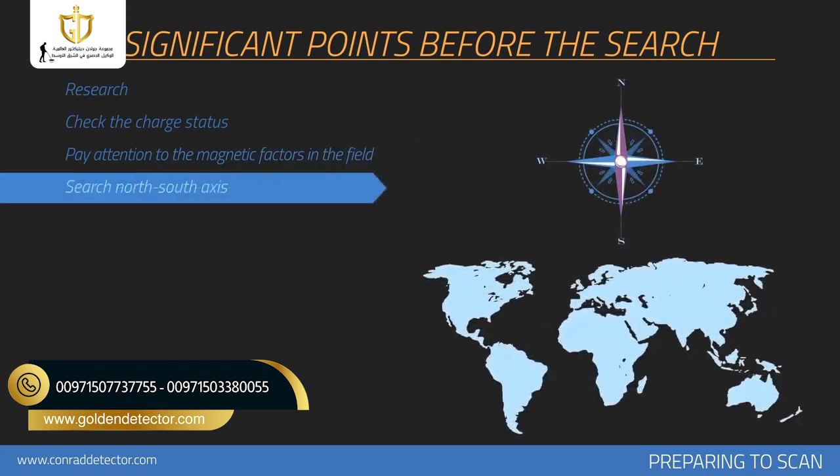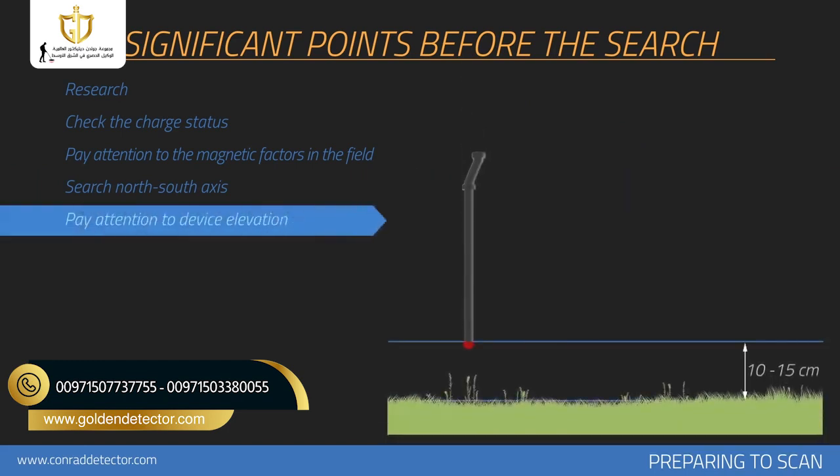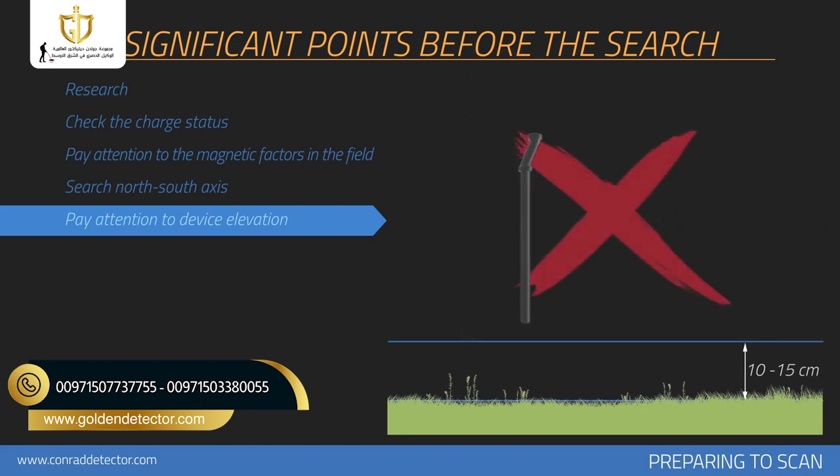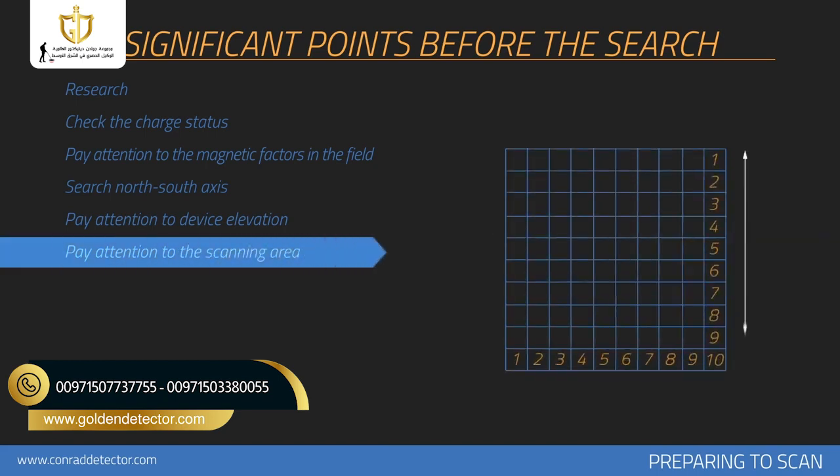In order to prevent your measurements from getting affected by magnetic fluctuations, scanning should always be performed with the north-south axis. Each search should be performed from north to south or from south to north. Using a compass to find your direction is recommended, and starting scans from the north is recommended. The device should be held vertically against the ground and should not be shaken. Your device's height from the ground should be between 10 centimeters and 15 centimeters and maintained throughout the collection of measurements. At least 10 signal pulses and 10 search rows, in other words 3 meters to 3 meters, is recommended for measurement size.